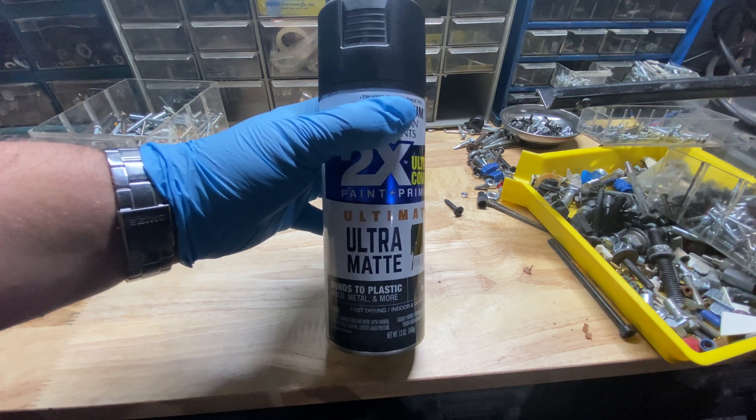I temporarily reassemble it so I can use my impromptu pressure washer to wash off any loose debris and dust. Once it's all washed off, I'll use some soapy water — following the directions — to degrease the surface so it's ready to accept the paint in the best possible way. Take your time, get every nook and cranny, and the last thing I personally like to do is go over it one more time with a wire brush — especially on metal — for a good final clean.